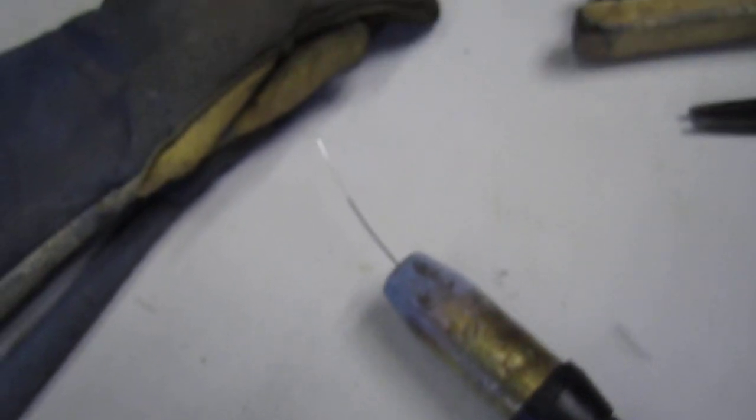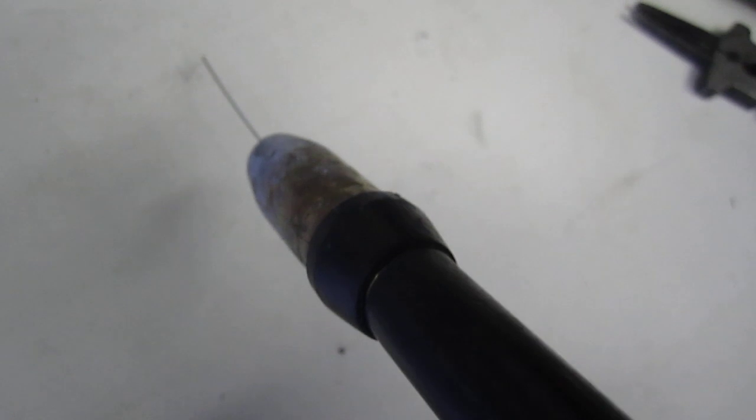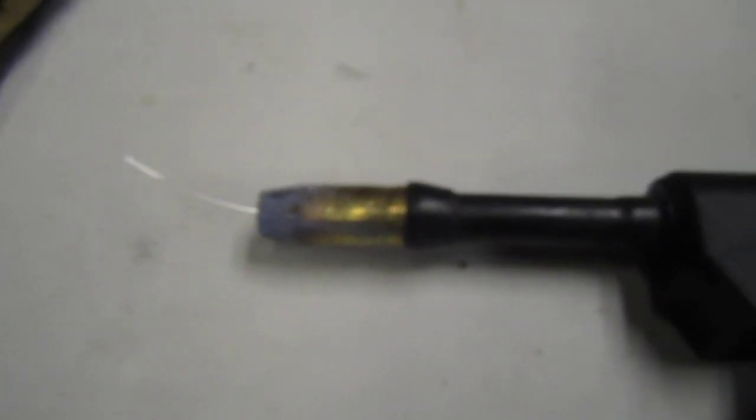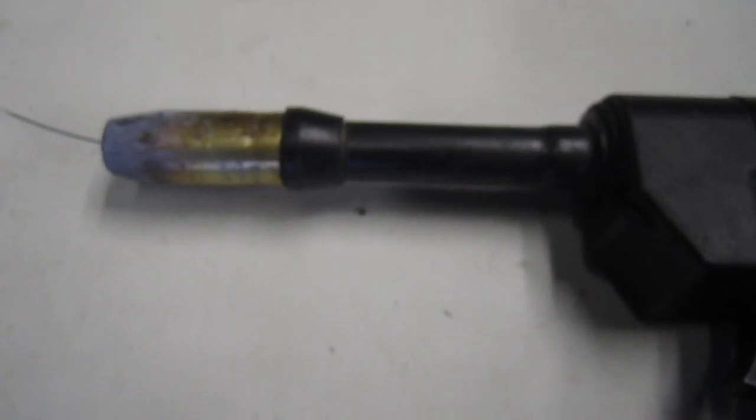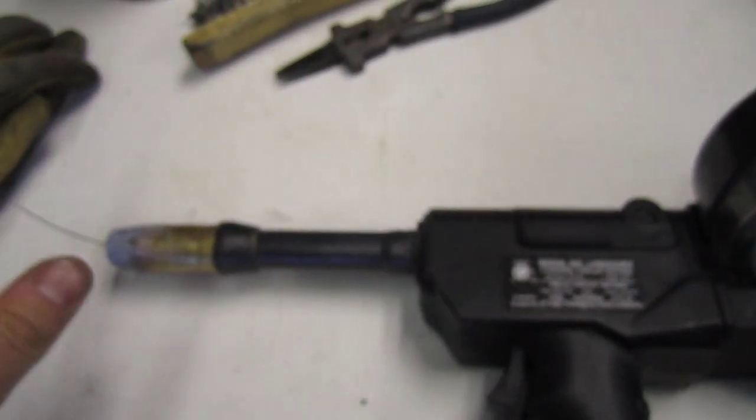At the end of your nozzle, you want the wire to come out with a curl, and you want to weld in the direction of that curl. You get that curl by adjusting that tension knob — either tighten or loosen it depending on how you're going to hold the gun. Keep the gun about 15 degrees off of straight up and down with the curl going in the direction of your weld. If your curl is heading the wrong way, you'll get a very black weld with a lot more smoke and it just won't look as nice. We run into this a lot with new guys in our shop.